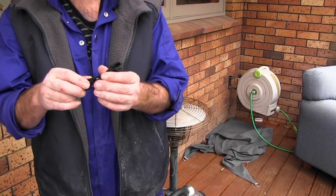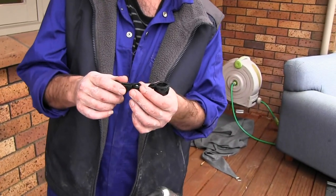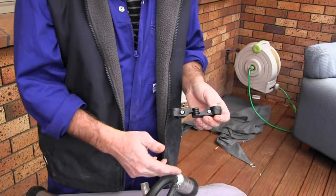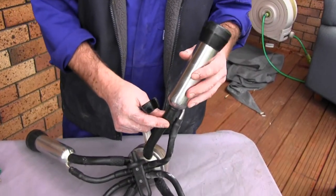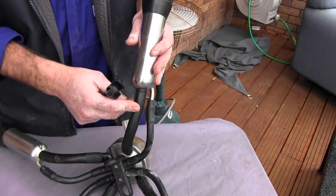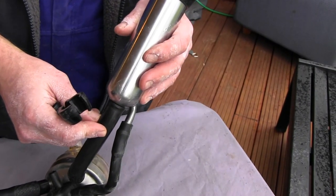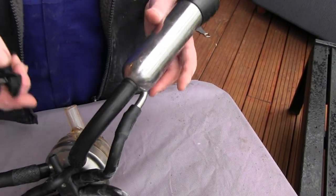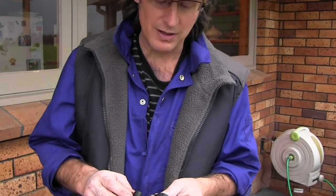Part of our design process, we've addressed the varying sizes of short milk tubes. With those inflations, we're finding there's a variance of anywhere between about a 16mm outside diameter to roughly about a 22mm outside diameter. So basically, we've designed it so that one size fits all, and we can actually get a really snug fit with our design.